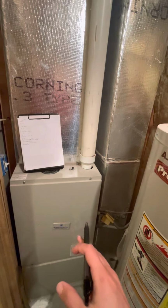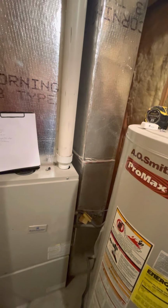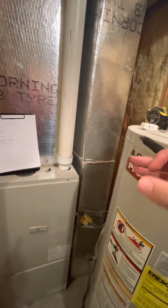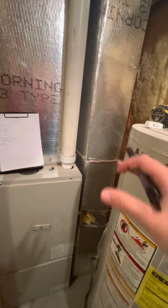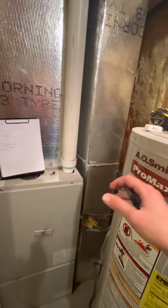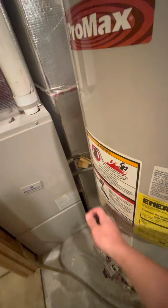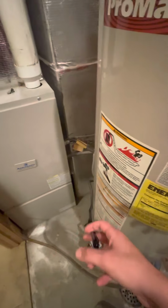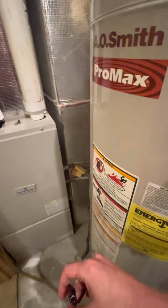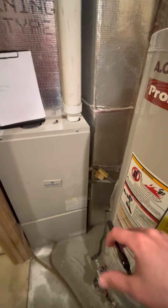We also have a duct board called a return drop, which I sized down to about an 8 by 24. I think it's a 9 3/4 by 24.5, giving about 2 inches down from there. And yeah, so that's going to be the setup. That does have a filter access right over here with a filter size of 16 by 25 by 1. It is kind of tucked away. Kay does have a little bit of hip issues, so it might be more stair related, but she was not able to change the filter, just didn't change that filter.